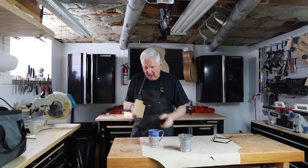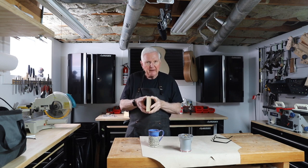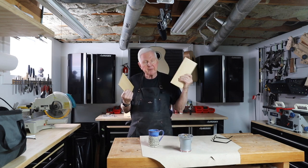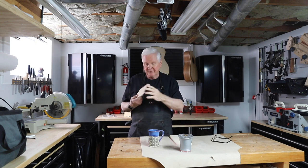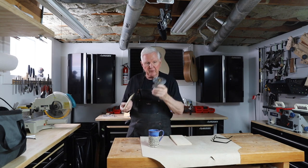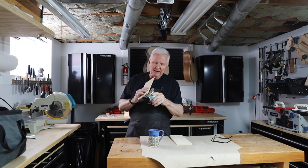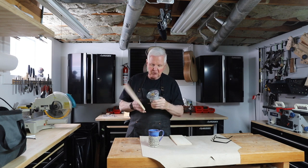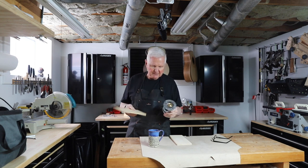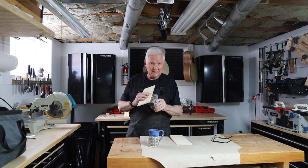We're back. This is the piece of pine — I ran it through and did the resaw. For some reason it runs off, and it's actually a good thing that it is running off. It tapered down in here. I'm going to run both of these pieces through the thickness sander to get them down to just over about a quarter of an inch in thickness. The reason for that is this is the housing for the rotor, and this is the guide — the bushing guide — I use in here. I want to make sure the guide is above so when I cut the circle it will run around there and not make a mess of the sound port.